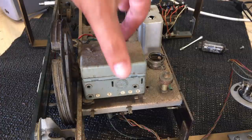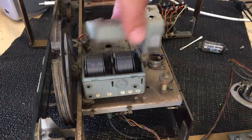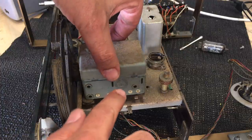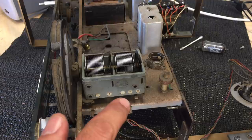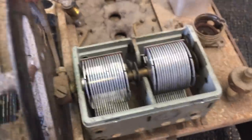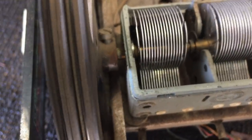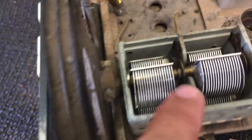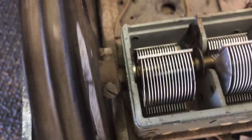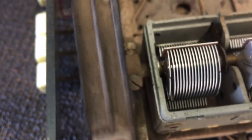Just so you know, you can actually take this lid off. There's a little indent over there, and on the other side you put in a little screwdriver, just twist it slightly and it's out. Which makes it a hell of a lot easier than taking the whole cap out. Having a look at this, I don't see anything too obvious, but something is definitely stopping the oscillator. There could also be a bad contact in there, so I need to clean those and see if we get any difference. Hopefully it's just a bad contact.